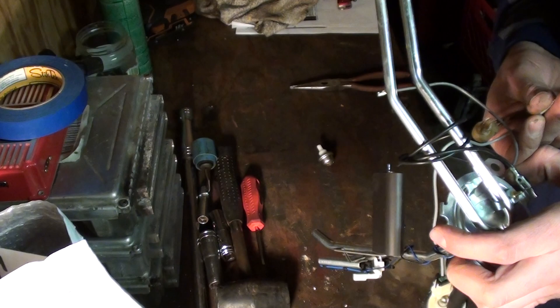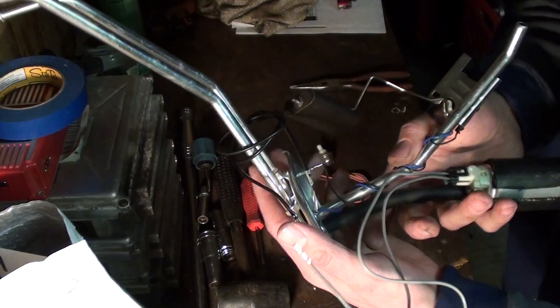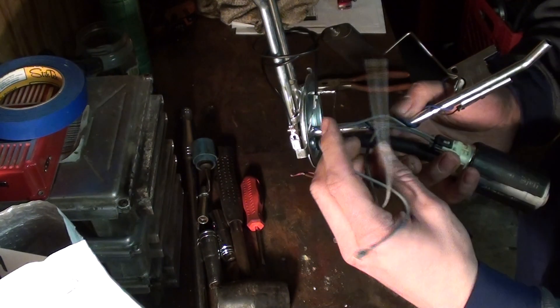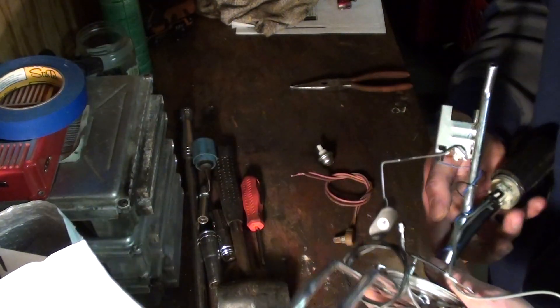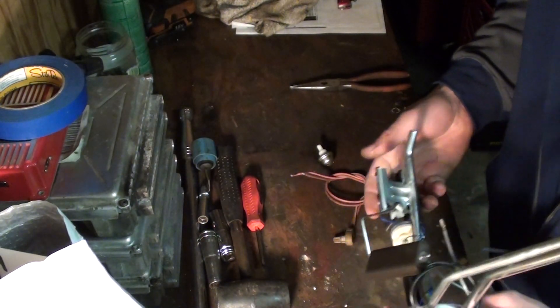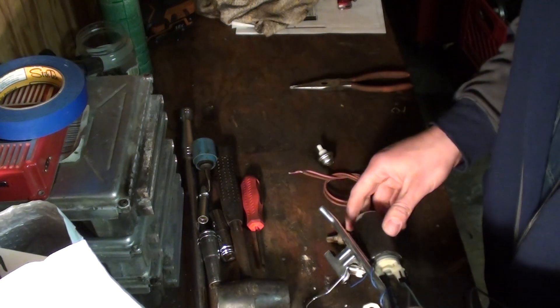Looking at these pins here — if you're going to rewire your pump, remember there are two terminals: A and B. A is always the ground. In this case you won't be able to tell from the video because they both look gray, but one is a darker gray than the other. The darker gray is your ground. I'm going to get to it and be back in a jiffy.